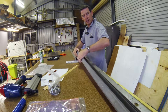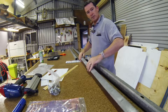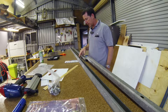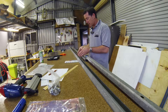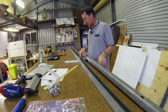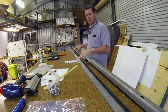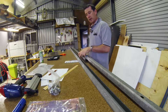So what I'll probably end up doing is — that'll go like that and join together there. So this actual track channel here will line up all the way. These aren't square — these weren't done by me — so I'll square those off so they'll be nice and flush. Probably behind it, because there's going to be a bit of slack in there, I'll put a plate on the back — an adjoining plate — and either rivet it in or bolt it in. This entire track will be bolted onto the wall anyway, so it's not a structural thing, it's just a guide. It shouldn't move, and that'll be good for the bearing to go in all the way up.